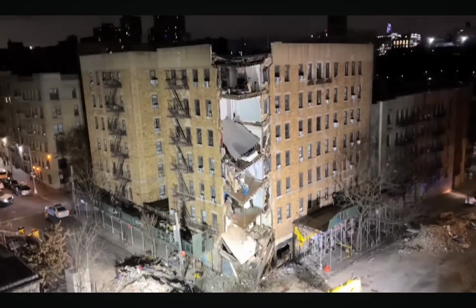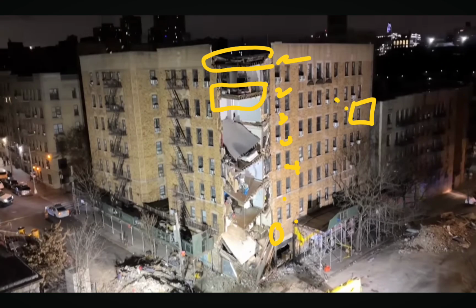So here are the floor and roof. You can see it in this one here. And I talked about the depth. So here's your five courses, four, three, two courses, the amount of courses reduces. So this obviously is weaker than down there. In relationship to the balance of the building, height-wise, it's perfectly doable. And don't hold me to the exact numbers. It might be six at the bottom and two near the top. And there is a veneer over top of the bricks also. They're structural and they're veneer bricks, so decorative brick. All right, the finished bricks.